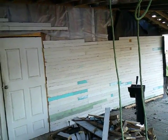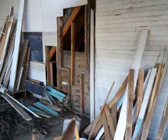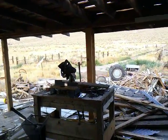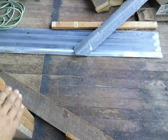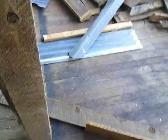Yesterday I got that section almost done — almost up to the ceiling on it. This stuff will carry over to the section of wall that'll go there, and all this wall up to that beam right there. I started taking some finishing boards — it's kind of dark in here — and started putting the finishing boards on that one. Still haven't done the front side because I got to wait till this floor is out of the way; I want it to go all the way down to the bottom so there's no end grain of my floor joist sticking out.